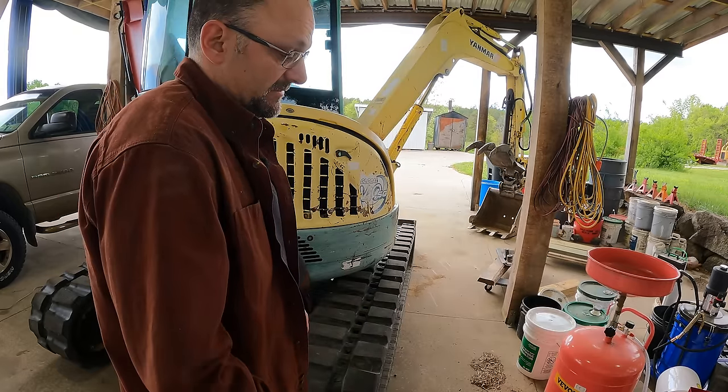The left valve is supplying the right motor, which was lazy when going forward. Now, what happens when we go in reverse? Well, these got flipped. So the left valve is now sending high pressure through this line to the left motor. So in reverse, the left valve is supplying the left motor, which was again lazy. So the left valve is what this points to.